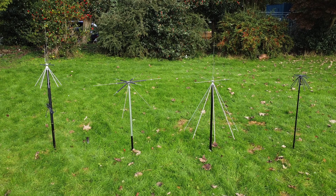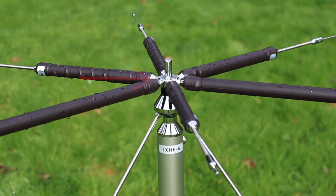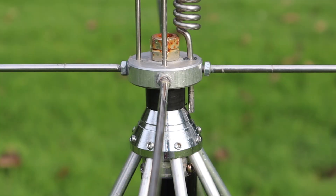The disc should have a diameter of 0.7 times a quarter wavelength of the antenna's lowest frequency. This is located at the top of the cone, and the antenna's feed point is at the centre of this disc. The length of the cone should be a quarter wavelength of the antenna's lowest operating frequency, and the angle of the cone is usually between 25 degrees and 40 degrees.